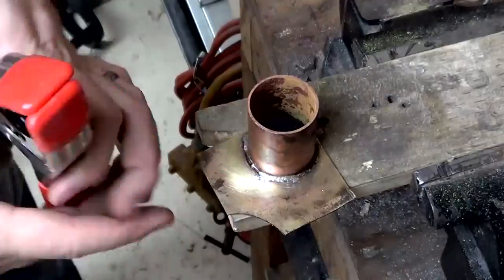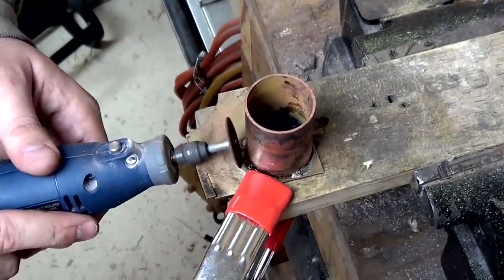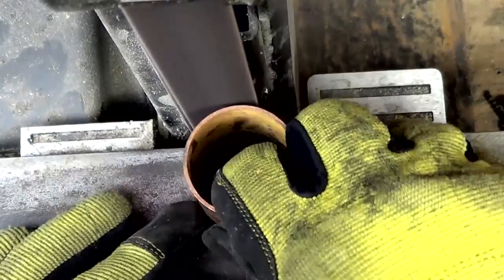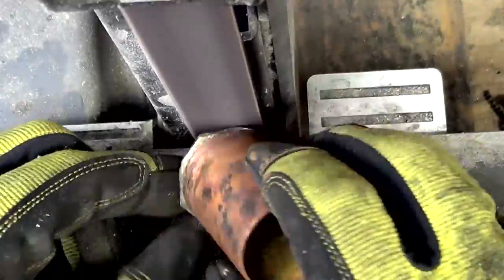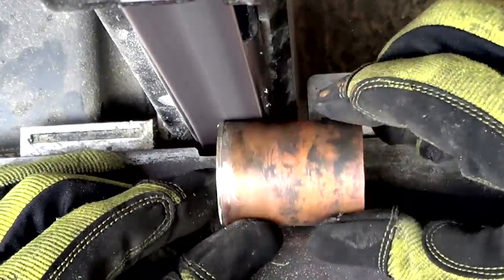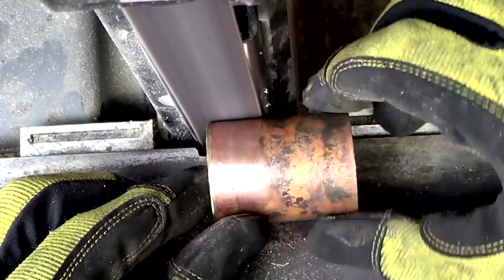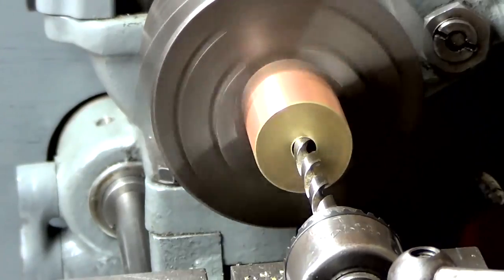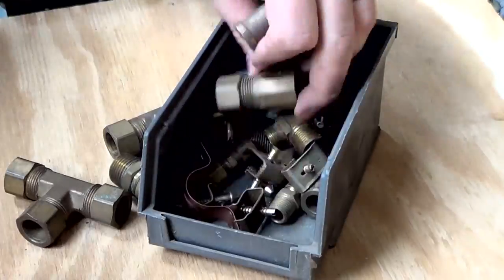The soldering in this project was really out of control, and that was mainly in part because I was not used to the different melting temperatures of the jeweler's solder. I bought medium and easy, and another variable that really threw me off was the different thicknesses of the actual pieces. So for instance, the plumber's fittings were very thick compared to the different sheets, which were extremely thin.